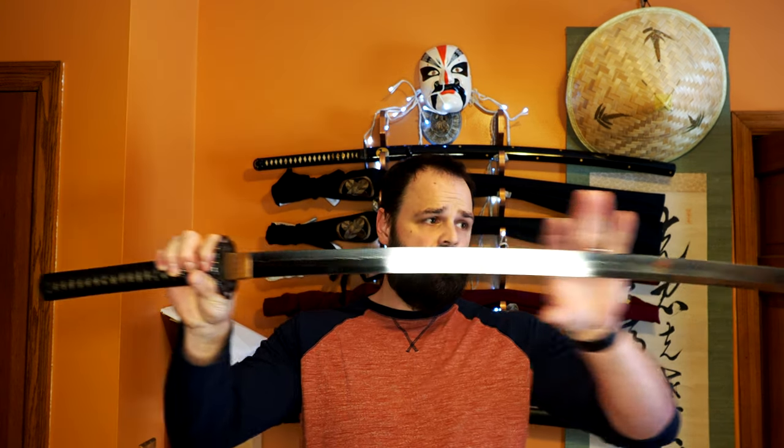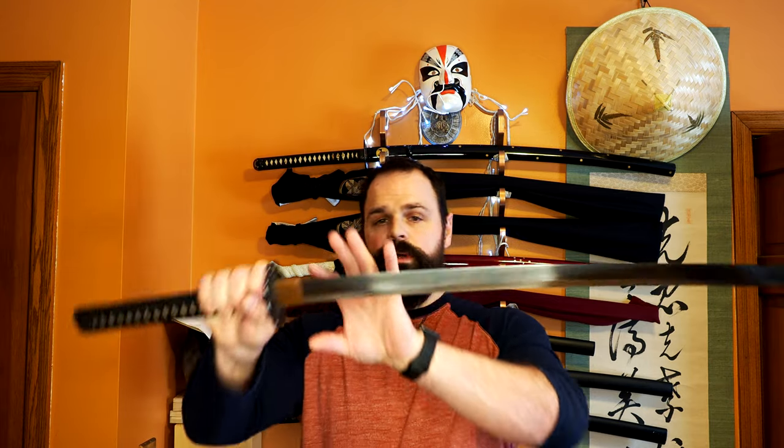Now I'm going to talk about the blade — the part of the sword that most people actually care about. The first thing to note is this is SKS III steel. Geometrically, this is a wide sword — it stays wide up at the tip. In fact, the tip is wider than many swords are at the base. It's wide but also relatively thin. That is a common geometry for competition cutting Japanese tatami mats. This one has a very significant distal taper — it tapers down to a very thin margin, and it starts off thinner than most swords do. That's going to aid in lightness. This is just a little over two pounds, making it very nimble. The cutting geometry will simultaneously be very thin. I'll talk about how that handles dynamically and in cutting a little bit later.